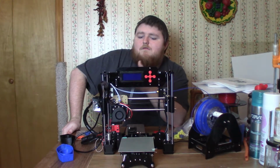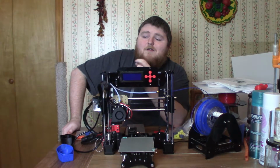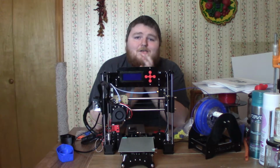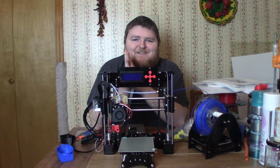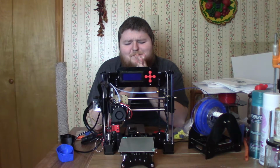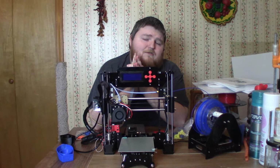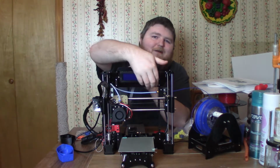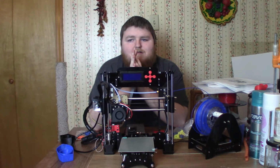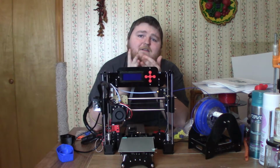Now, this isn't the only printer that does this with the build height. What would be the good word? Stretching, yes, literally stretching. The Ender printers are very well known for this, because people go, oh, 180 on the build height. Let me print this 180 millimeter object, and then chaos ensues, because that whole gantry starts rubbing on that top sheet metal lip, cutting cables, cutting filament. Bad time for all. So yeah, this is not the only company that does that.